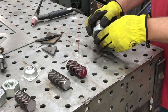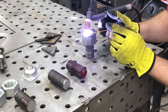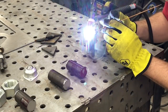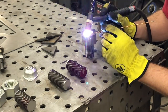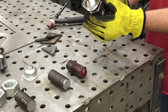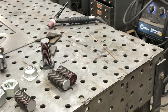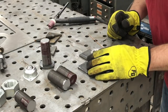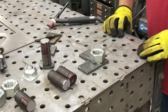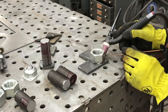I didn't show those leveling pads being cut out, but those pads match up to those little conveyor ball bearing guys. You can see I'm using the center hole with that little shoulder to square up against it, and I've got the bolt in there to make sure everything stays square. Once you put a tack in, it'll actually suck itself down to the squareness of the bolt onto the threads, and then you can weld the rest of it up. You saw that other piece I made — the angle corner bracket with a hole in the center. Here you see I'm using the nut part of it. These are going to be leveling feet and you'll see it coming together shortly.